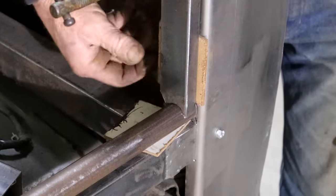So this is my final dry round to check everything out — everything looks great. Unfortunately I can't weld it now because those plastic bushes are still in there and they will melt. So I'm going to have to disassemble the whole thing, take the bushes out again, then tack weld it together, and then we can see where we go from there.